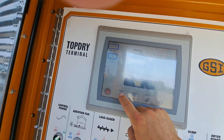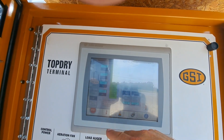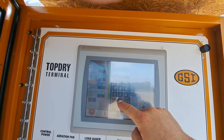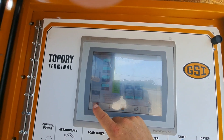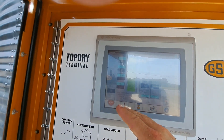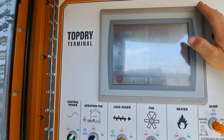We have our temperature — we can look at our four temp sensors and make sure they're reading equal. There's a max grain sensor differential. I'm going to bump that up some. The only reason for that grain temperature differential to get off real far is if you have a chute plugged or a chute that's not dumping grain the way it's supposed to, and then one temp sensor will run hotter.